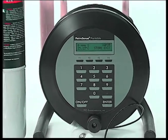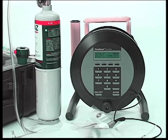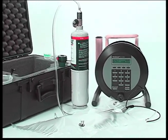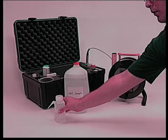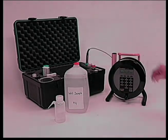Remove the probe from the bag and place in the humidity tube. Before making measurements, the probe has to be zeroed. Place the probe in the green zero PPM tube with zero PPM water. The probe is zeroed by pressing F1 in the measurements menu. The zeroing process takes 5 minutes and ensures a stable zero. A stable reading is indicated by the letter S appearing beside the PPM reading on the display.